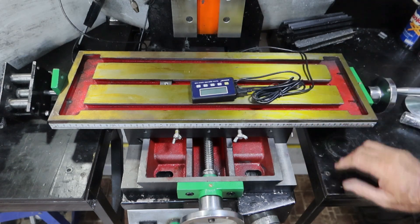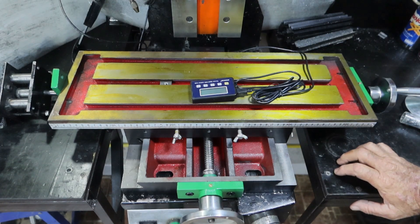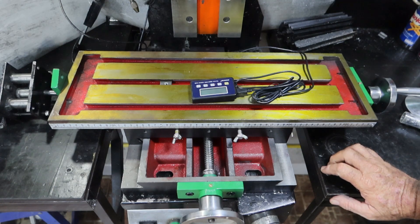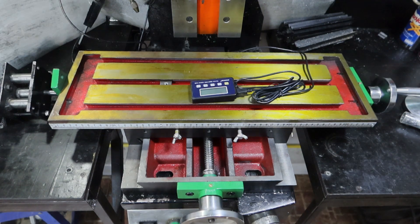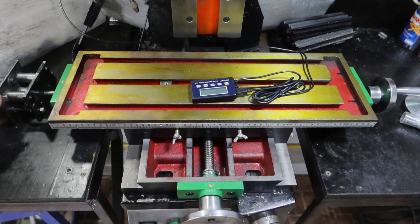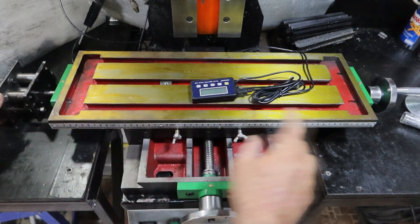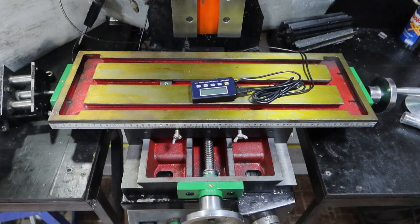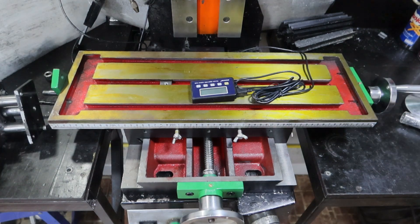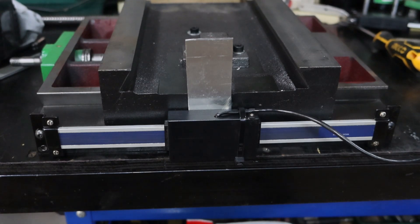After a closer look at where I've got to mount the Y-axis DRO, I think I might be able to get away with what I did over on the back, down underneath here — so I'll be able to do it up on the bench instead of trying to do it down in there, which is a bit ridiculous. I've also got to modify this and take that damn lead screw out, machine it down some more on this end, and this handle won't fit on this end so I'll have to turn it down a bit to get it to fit.